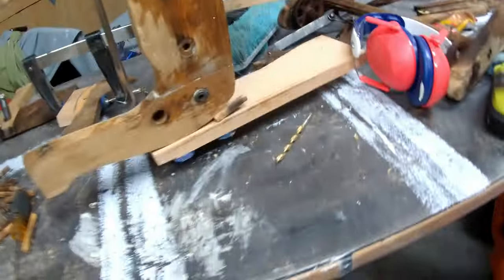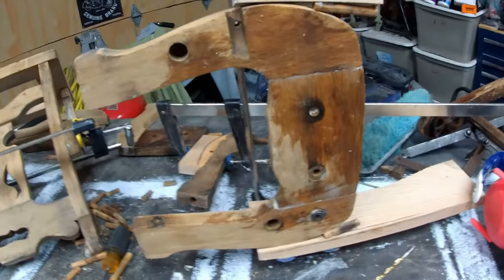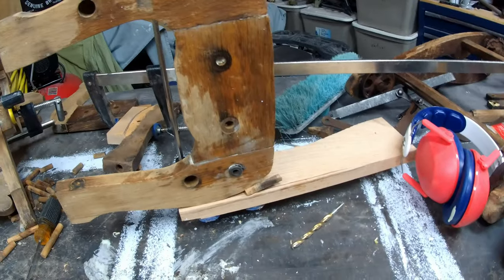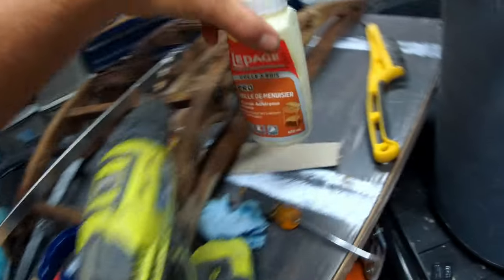Tonight we can cut it and start putting that one together. This one was kind of a pain to put together just because of the angles — that's the way I've jimmied it up and clamped it pretty good. Let that sit overnight. The glue actually sets a lot faster but I still like to let it sit a good 12 hours before I start using it again. These new PVA wood glues set pretty fast, but still better to give it more time.